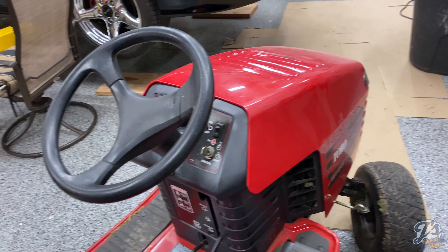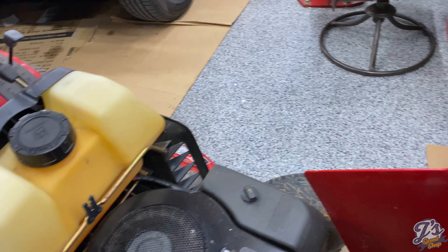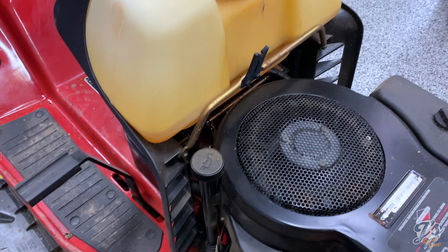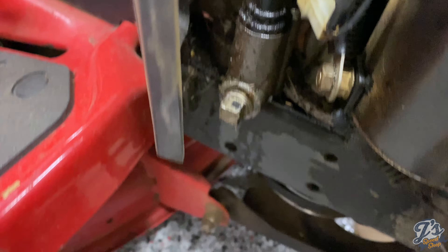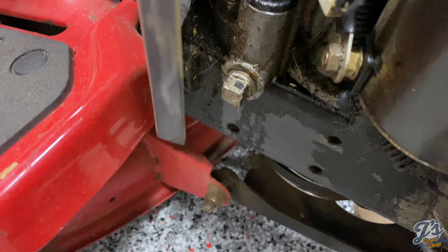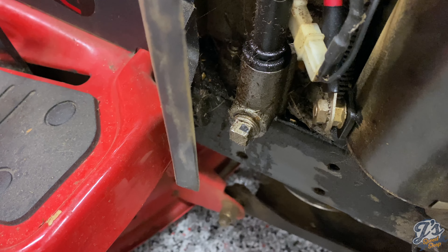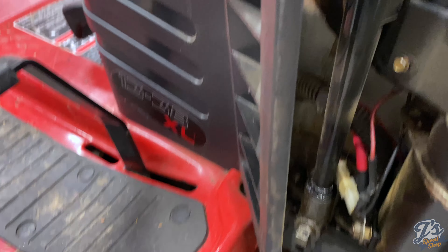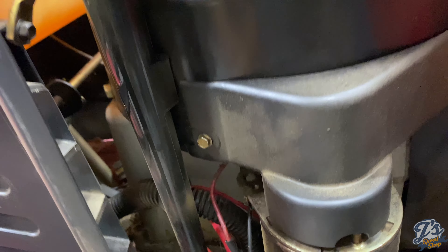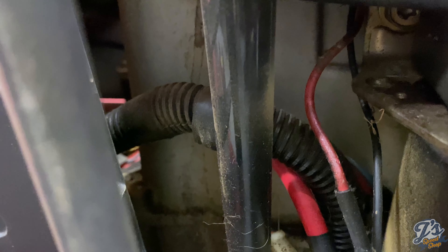The tractor's got an oil leak, which I think is mostly at the drain plug - or actually, it leaks at the dipstick tube. It may leak from the plug itself too. We'll change the oil and put some Teflon on that and put it back in. I think I had taken this off when I had the motor apart to get the mouse nest out of it. You can see it when you wiggle it - it's not sealing down there.